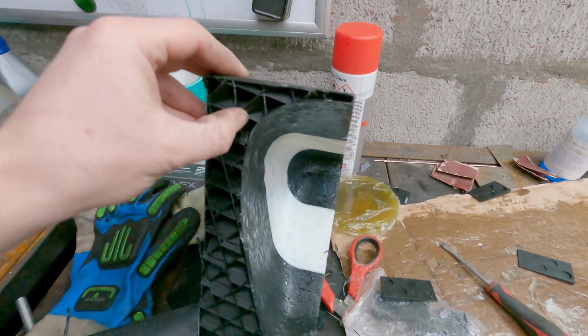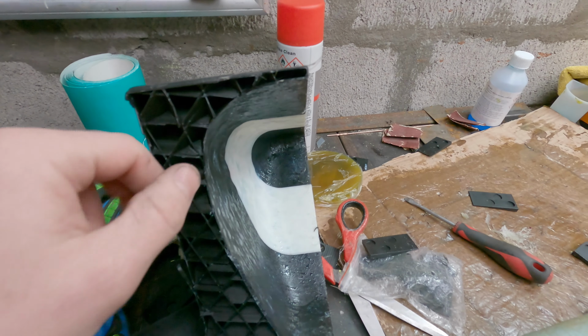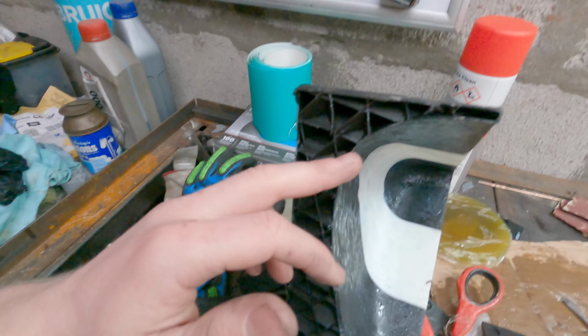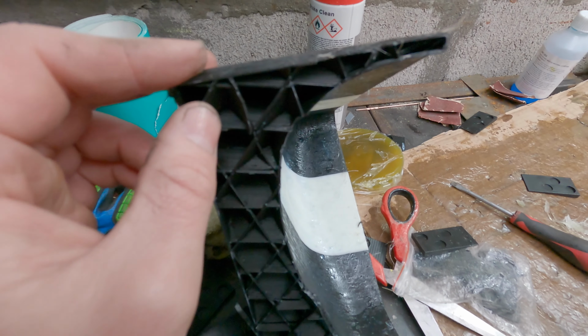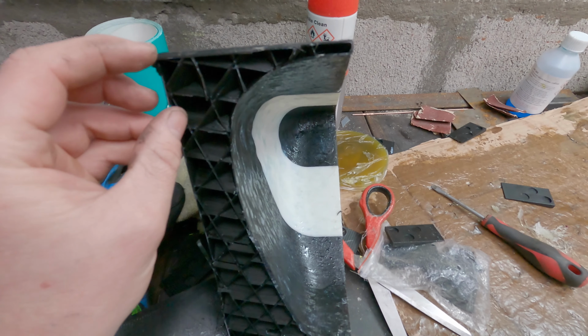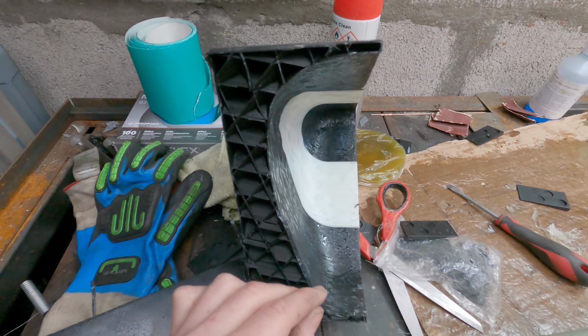But also, when you look at the mould, this is my naivety in learning how to do this, but the mould's only like 15% infill, and the wall thickness is not very thick at all. So if I was to remake this, because it's quite a strong shape, I would probably, once I'm finished and happy, add a little bit more of a draft angle all the way around, so it's more like a V. But also, instead of dicking around making a nice square mould, I would just spend all this extra effort making this shell like 2-3-4 mil thick all the way around.